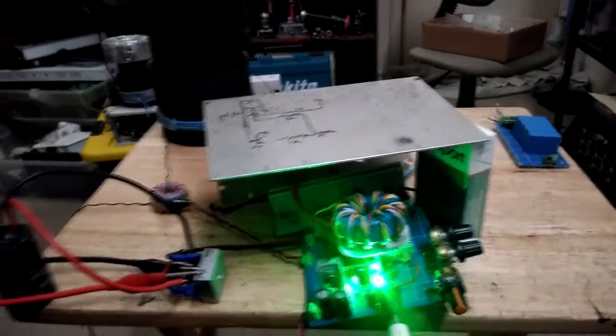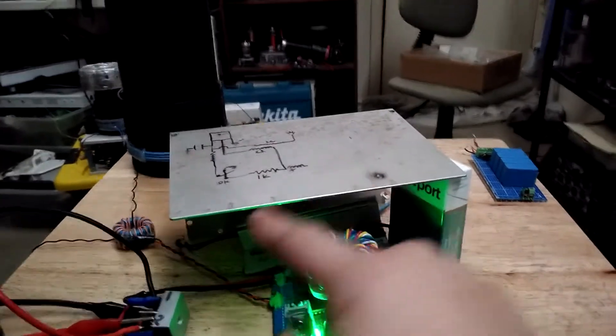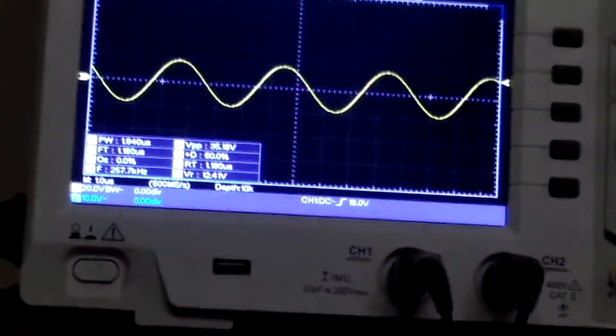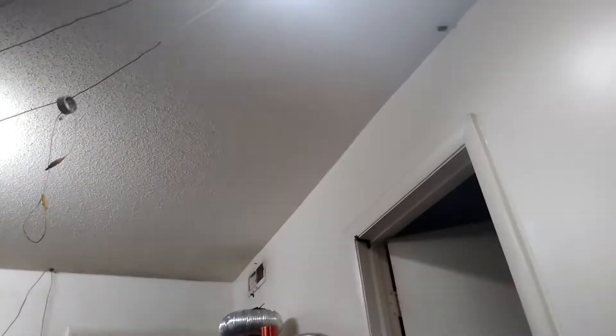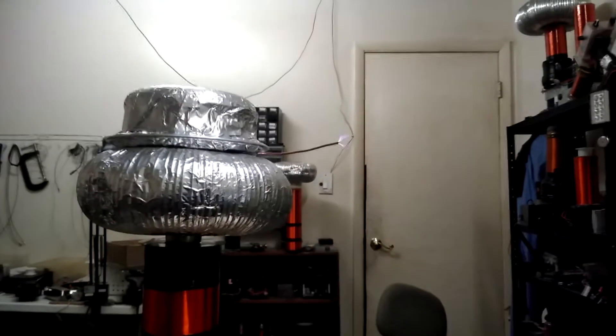Or both of them. Continuing on with this full bridge setup, running this coil now — this is the coil I plan on running on it. I managed to get away with putting this little shield over it where I can tune it a little more reasonably. The problem is I ran into a snafu where I done goofed — that coil is actually running at 260 kilohertz instead of 160 kilohertz like I originally thought. Obviously I can still run it interrupted. My light started dimming when I cut this up — the field is strong. It's not looking like I'd get away with continuous wave.